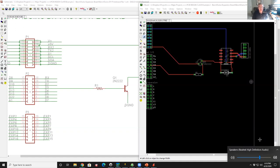And what you'll figure out is you can bang out a new project because you're used to using the same 50 parts. In fact, every new project never starts with a blank schematic. It always starts with a copy of the old schematic of the old project. And then you spend 20 minutes ripping out the stuff you don't need and starting to assemble the new circuit out of the parts that you do need. So you'll wind up with the same power supply circuit, likely, over and over again for multiple projects. And that's how you get really good.